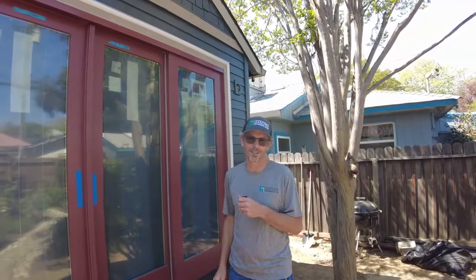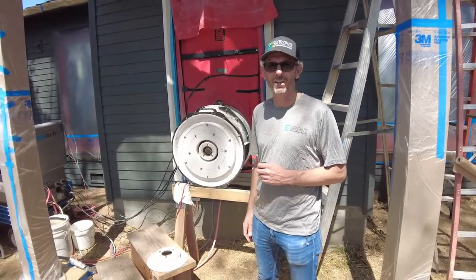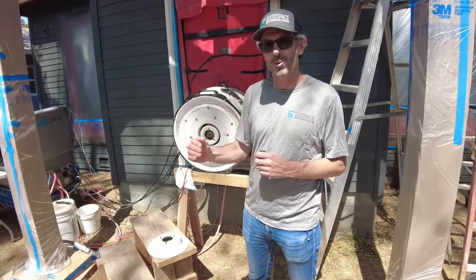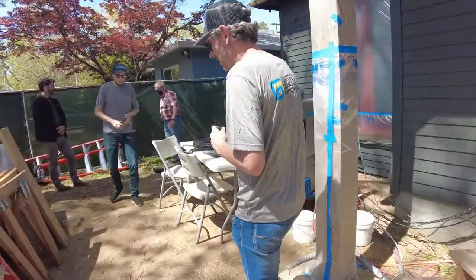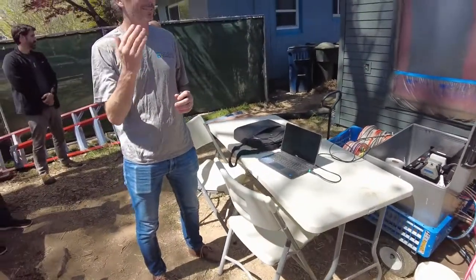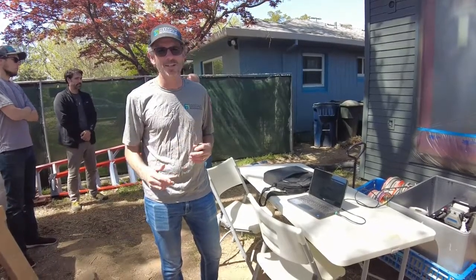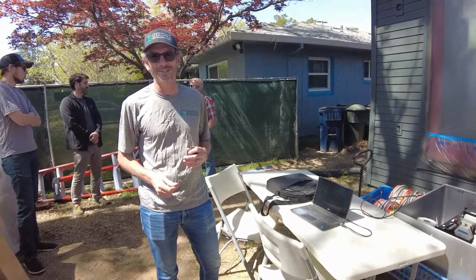We'll be jumping on soon to look at what our final air sealing numbers are. The blower door test has been running for an hour now, and you can see they've put more rings on the fan because there's not as much air going in — most of the holes on the inside are sealed up. We started at about 4.5 ACH50, and after an hour we've got it all the way down to 0.4 air changes per hour, which we're very happy with. The guys are going to shut this down and clean it out, and then we'll go inside and look for evidence of what's been sealed.